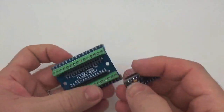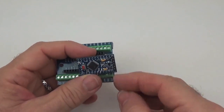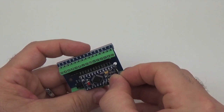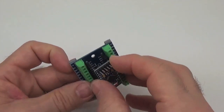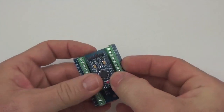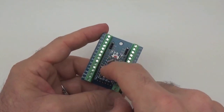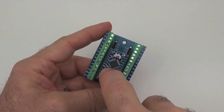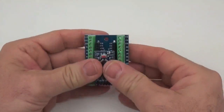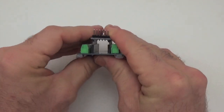And again, you want to make sure you've got your RX and TX pins aligned. So that's over here by the UART connectors. There's the RX and TX. And if you get the pins aligned, the digital side of the board, the labels match. They won't match on the analog side, and again, we've repurposed some of the analog pins to deal with the I2C bus. But if you get the alignment correct, you want to make sure that you're applying a gentle, even pressure to get it on.